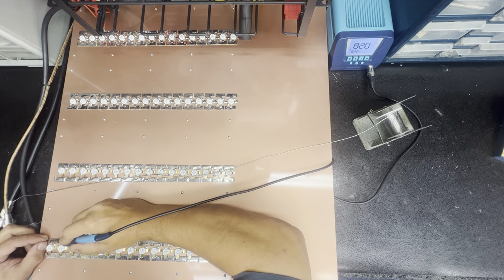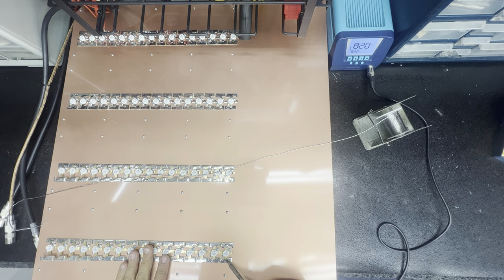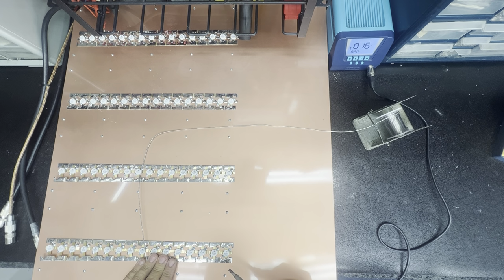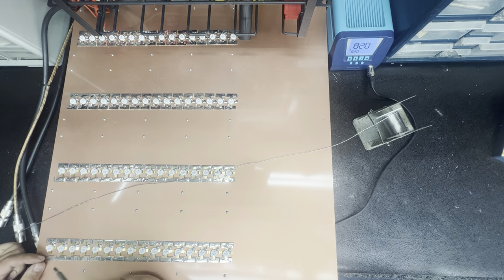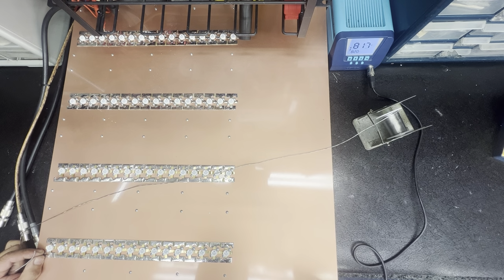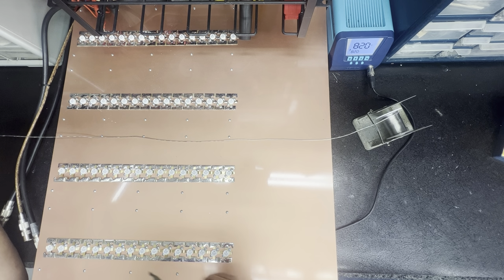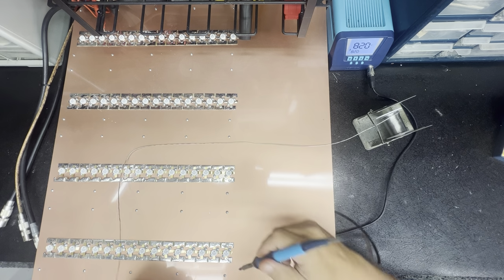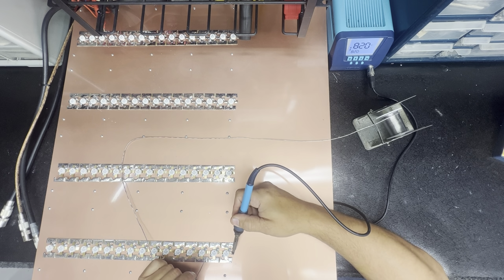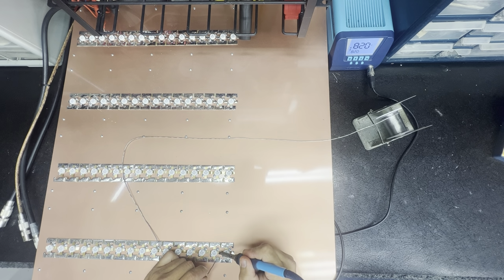I didn't think about that variable voltage power supply thing until we were sitting here talking to myself. When you do variable voltage, you're going to end up with one power supply putting out, let's say, 15.5, another one doing 15.4, another one doing 15.2, maybe another one doing 14.8. And what's going to have to happen is the one that's doing the most voltage, you're going to tax it down to the volts of the lowest one before it goes to the next one. So variable voltage is way worse. It's different length wires. But it works too. There's a bunch of them out there with variable voltage. And it ain't as bad to do variable voltage on one with like 2 or 3 models, like 100, 150 amp. Ain't no big deal because there's not enough there to worry about. But you start doing it on a bunch of power supplies, you don't want to do it.